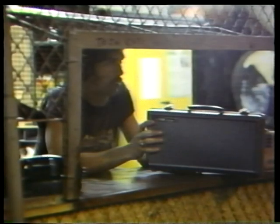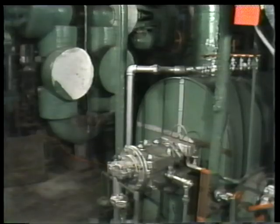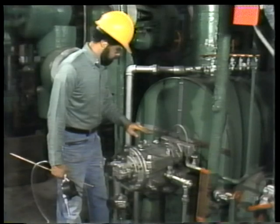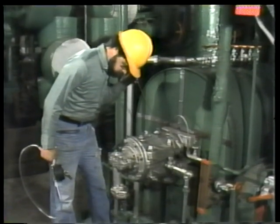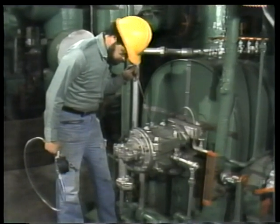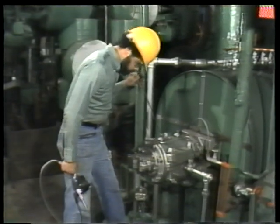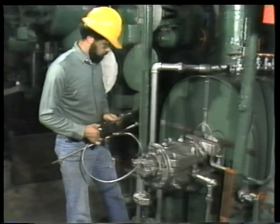If bearings are reported to be running hot, your first step is to find out how hot, with a pyrometer — an instrument for measuring heat. Our mechanic will be checking both of the bearings on this pump. First, he feels the thrust bearing to see if the casing is hot to the touch. Then, before using the pyrometer, he listens to the bearing with a sounding rod. While the shaft's rotating, rumbling or grinding noises coming from the bearing housing can indicate excess clearances between the shaft and the bearing, or other bearing problems such as lack of lubrication, misalignment, or damaged parts.